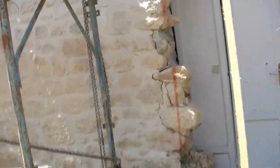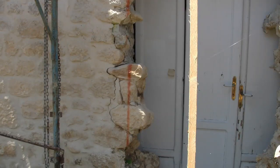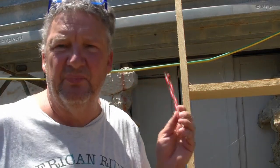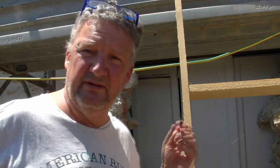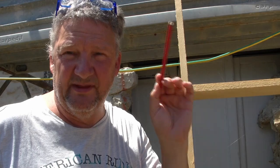The two stones going across and the keystone, I'll wait until I've started the sides, and then I'll drop a plumb line down, and that'll give me some degree of assurance that we're all in line. So once I have put the first two stones in from the foundation upwards and they're in exactly the right position with this former in place, then we'll start to look at the other stones, but obviously special detail across the top with that keystone.